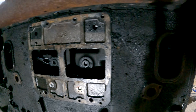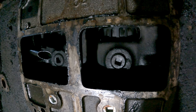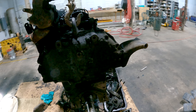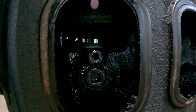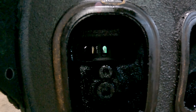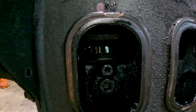The air box covers are off of it. This is where the blower puts the air in right here through these two big holes, and the air box completely surrounds both sides of the block. The center of the block holds all the liners and the air box goes all the way around it, so you're actually looking all the way through from one side all the way out the other through the liner ports — and that's number one cylinder right here.